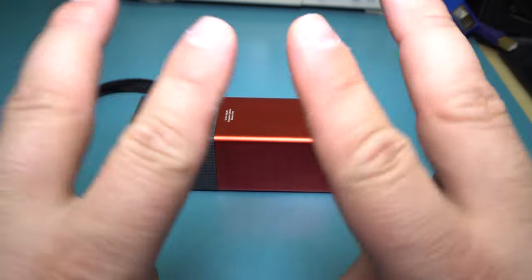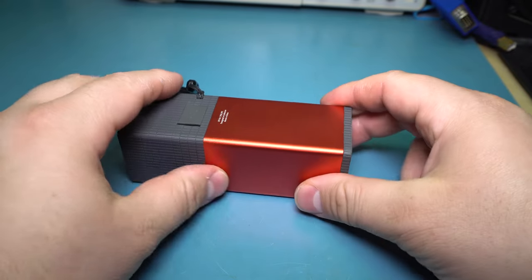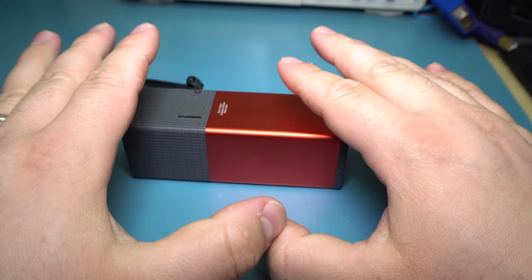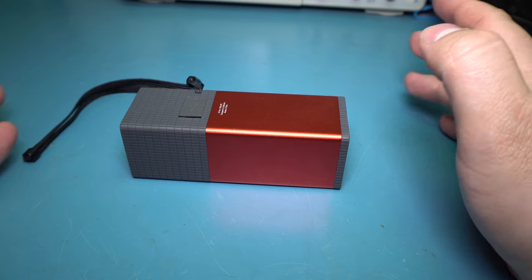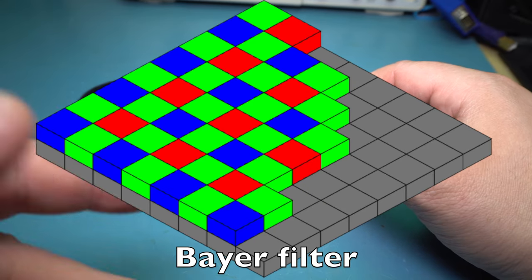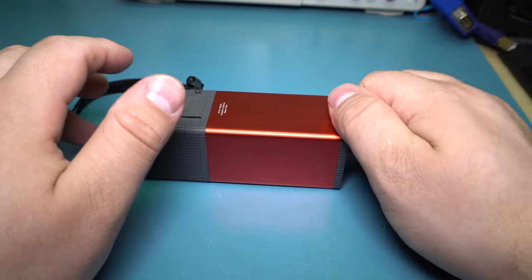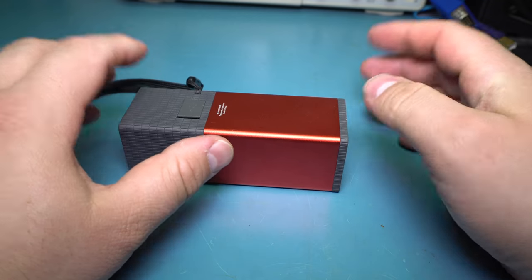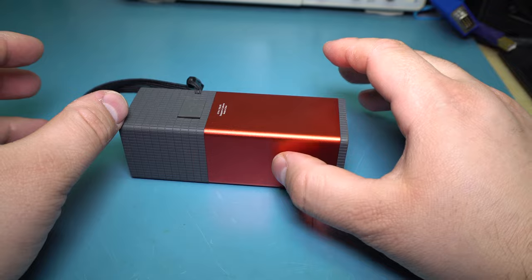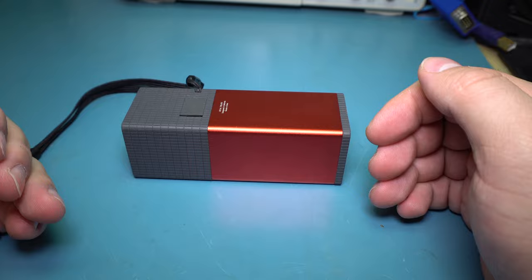Basically, this thing captures light rays. In a normal, standard camera, you have a two-dimensional sensor and it reads color information — light information. There's a filter over each sensor which essentially gives you color information, but all it can do is capture the light intensity. There's no real information beyond that. The focusing system in the camera is what determines what is in focus.